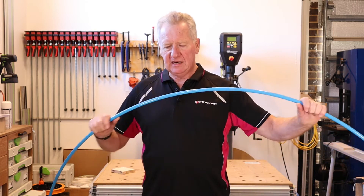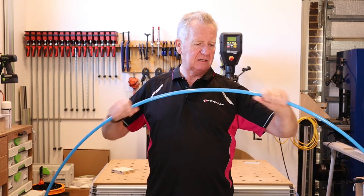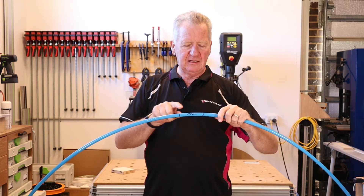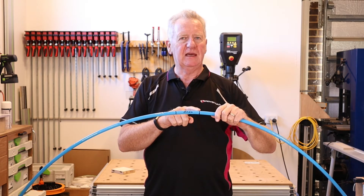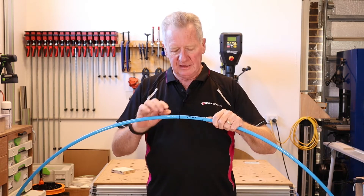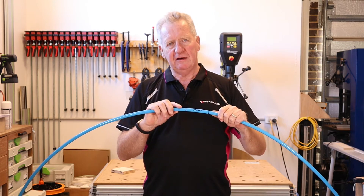The cable we've got today is a 144 SmartCore cable. What I've done is gone from the end of the cable and marked a position here which is two metres up from the start of the cable. This is where we'll strip the sheath back to, and then I made another mark 90 millimetres further up from that, which will help us position the mechanical gland in the right place when we come to install it. It is important that you know the diameter of the cable, so you can either use a vernier caliper to measure it or make reference to the lookup table that now follows.